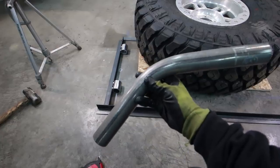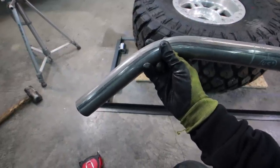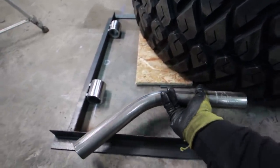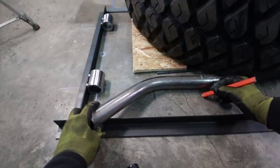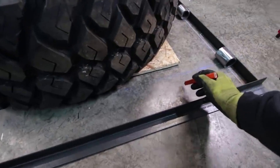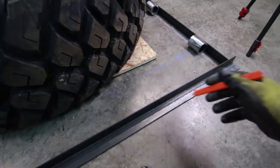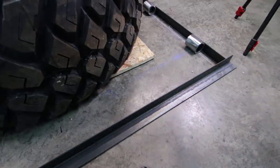This is a pre-bent section at about 45 degrees. I'll probably need a little more than a 45, but this should at least get me to where I can see about where to put the center of the bend. There's a part on my bender that I have lined up at this white mark. All I need to do is set this so the center of the bend is really close to where I need it, mark that point, measure the distance, mark it on the other side. I'll probably cut a five-foot section of tube, lay it down, make the marks, put it on the bender and get something close to what I have marked here on the floor.